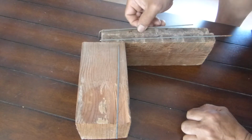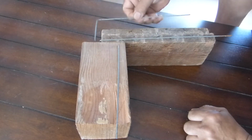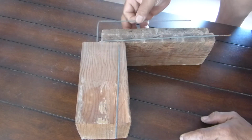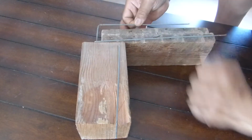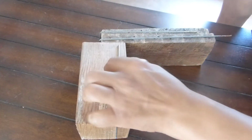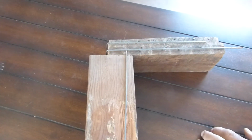The steel has about a 12-inch leg on it, this little leg here. Well, if I do that, and the deck is 9.5 inches, you see it can't make it. The rebar bend is too big. You can see the gap back here. So that doesn't work. You don't get to place the steel where you need to place it. Then you've got this steel that sticks up just a little bit. Right there. So now, watch what I do here.